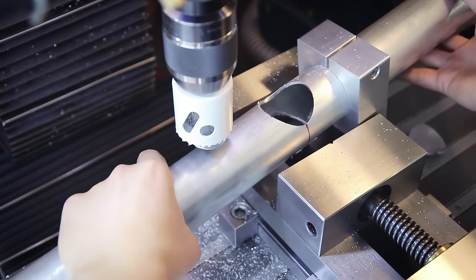Now that all the main welds are finished I can put the frame back into the jig and check for distortion, which is one of the things the welding table really excels at. All of these cones here are turned to be very precise and set up with their centers at the exact same distance from the welding table, representing a very flat reference to measure against. We can now see that the seat tube distorted downwards slightly, but otherwise the rear end is looking pretty straight. However, in front there's quite a bit of distortion — the distance between the frame and the standoffs varies quite a bit, which means the head tube has moved upwards.